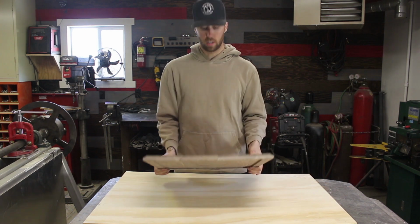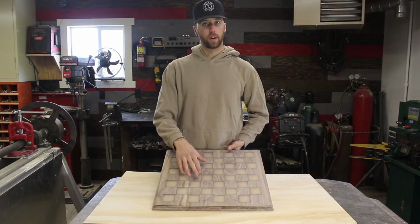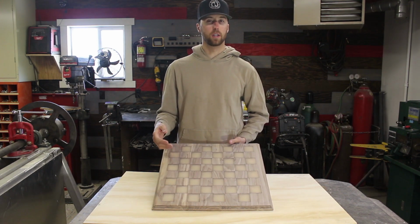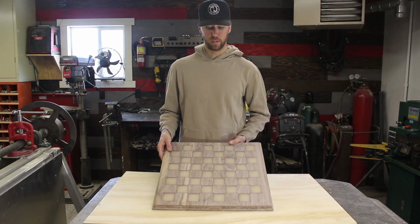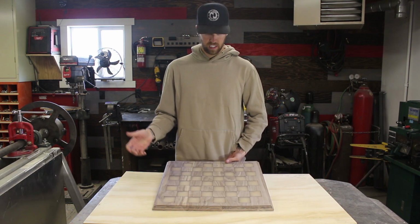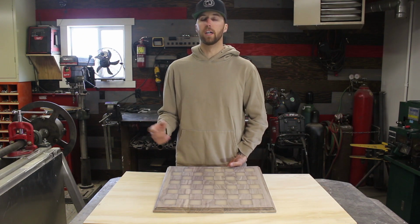But it's also quite common, and that is to use old epoxy in your projects. Now, the epoxy I used, it wasn't that old, and I thought I took the proper precautions. It was kept at room temperature. I mixed it up quite good before I used it, and I even heated it before I used it. But after I was done to pour, I noticed there was quite a bit of sediment left over in the hardener side of the epoxy.